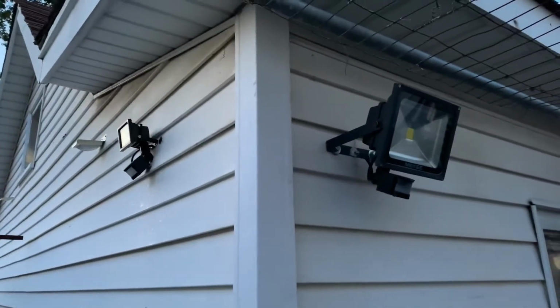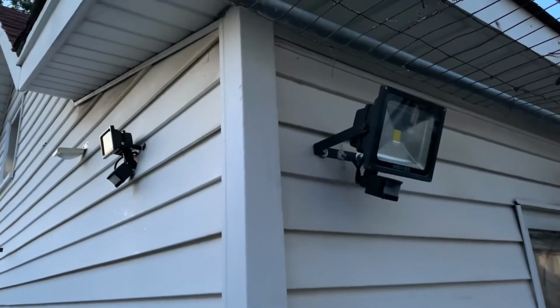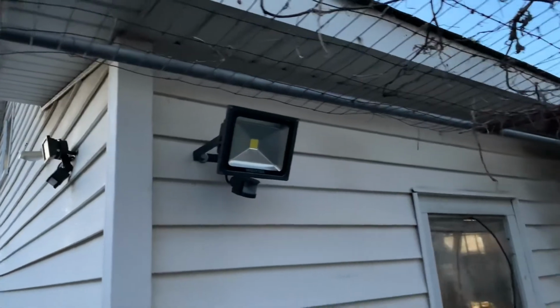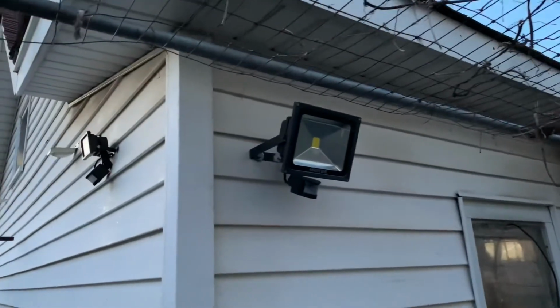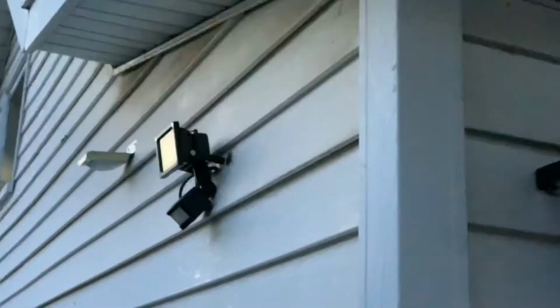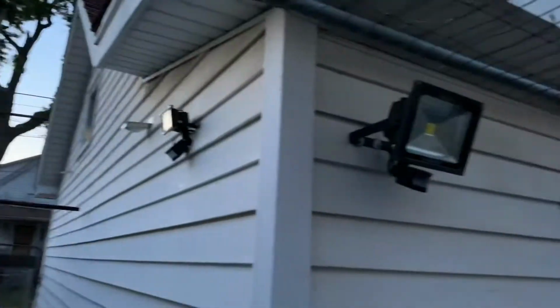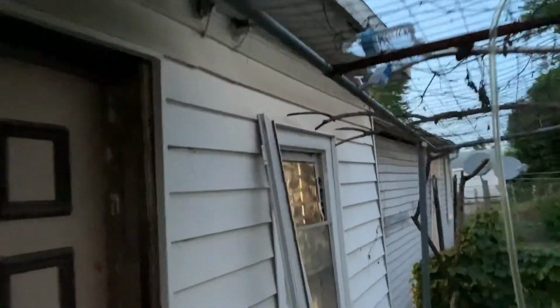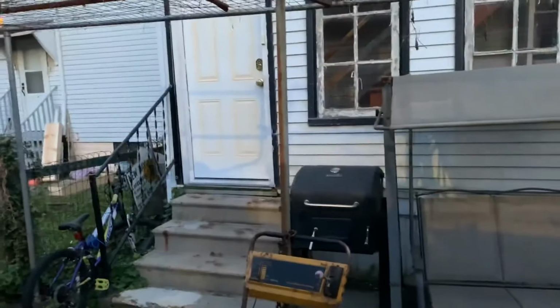This was an AC system. I'm going to switch over to a DC system so I can use a proper relay, because when I looked up the relays for AC, they were more expensive. So I'm going to have three lights now, one somewhere around here, another one exactly there, another one somewhere around on that side, so it can light up the other side, my grill area, and so on.